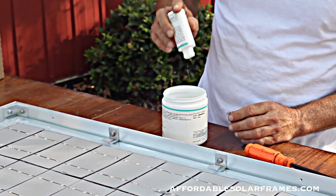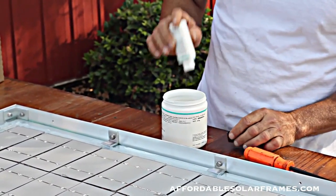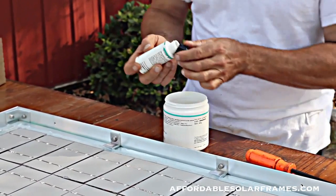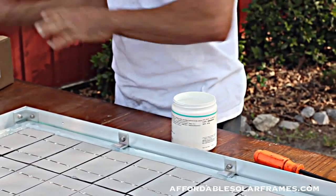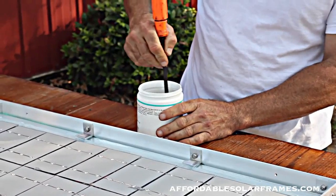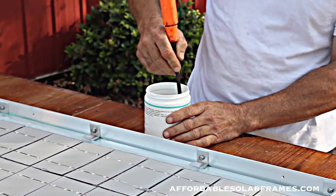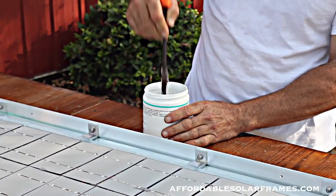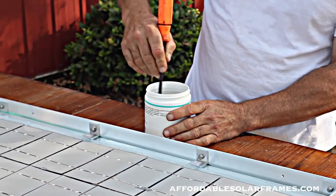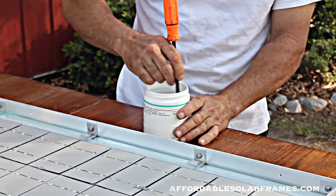I like to build my solar panels in the fall and in the winter. The slower the setup the better — it gives more time to move around and slide under the cells and get rid of air bubbles. In summertime this stuff will heat-cure, so you've got about two hours to work with it. Don't get in a hurry. Just stir it slowly.